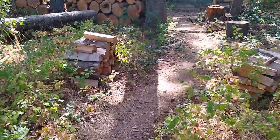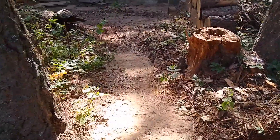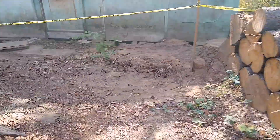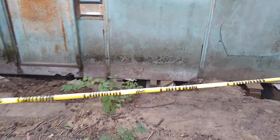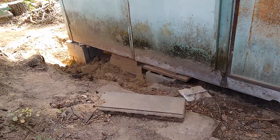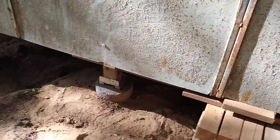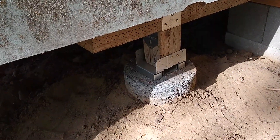Mostly what happened at Tall Pine Cabin is some more foundation work, although it doesn't show that much. There are some piles of dirt that I've moved, and you'll see there is some enhanced mitigation for any water that may flow into or below Tall Pine Cabin. We didn't want to interfere with the blocks currently there, so we did some ditch digging to allow water to flow through or around without disturbing these foundation blocks. We also took advantage of those pier blocks poured a couple months ago — now able to hold weight — by putting weight on them. There's one on the east side, and as we go around to the front...